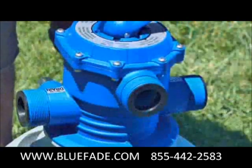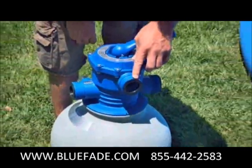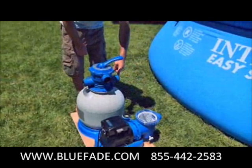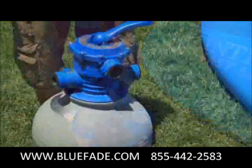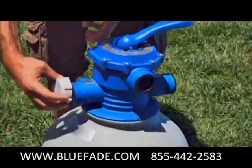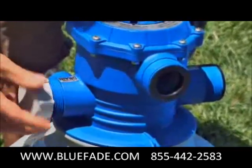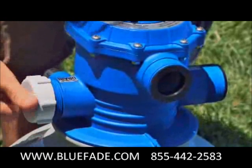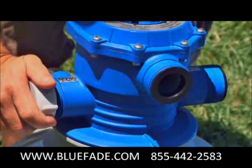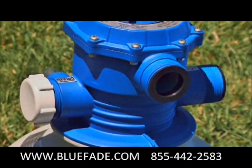There are 3 hose ports on the valve. The water inlet port must be aligned with the motor outlet, and the water outlet port must face the pool. The 3rd hose connection is the drain waste port, which is protected with a waste cap. A separate hose is not provided for this port. When backwashing, rinsing, or draining, you may use the hose from the filter to the pool after closing the plunger valve on that side.